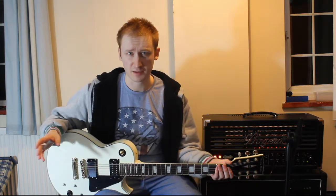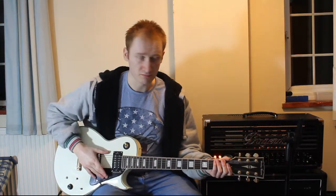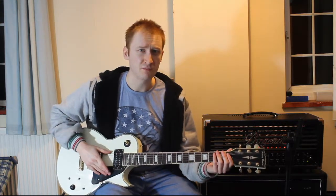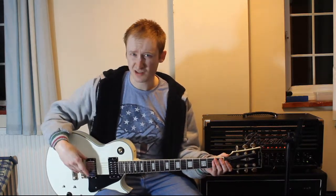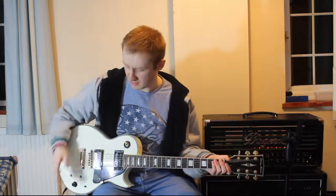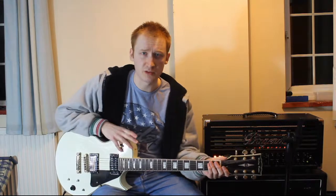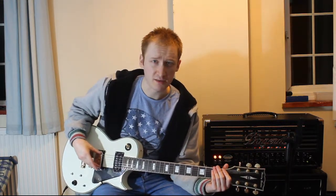I'm not sure it's going to come across on YouTube, but on the clean parts you might be able to hear a slight volume difference. This is still slightly too weak but it's very close, so the next prototype is going to be wound slightly hotter — there's definitely still room on there for a few more winds. I reckon I can get a good match with this wire gauge.